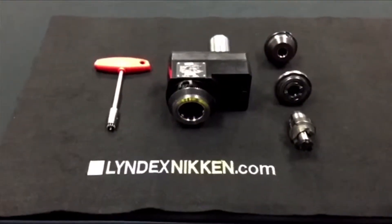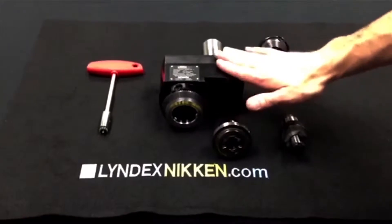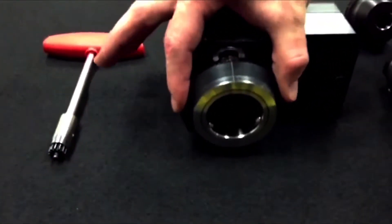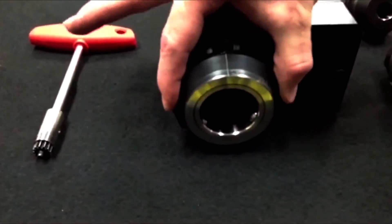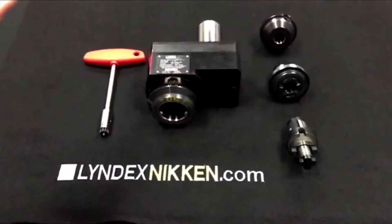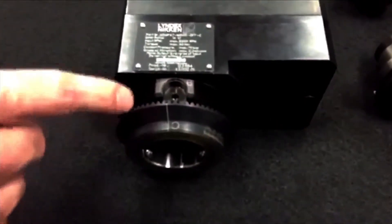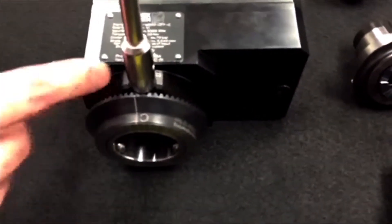Now I would like to show you how to properly insert the MI adapter into the base holder. Preparing the base holder: the base holder has a MI thread ring and a spindle bore. You want to make sure that this MI thread ring is slightly raised to the spindle bore. When preparing the base holder of the MI system, one must align the MI thread ring to the spindle nut by utilizing the markings on the thread ring and the spindle nut.